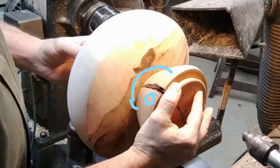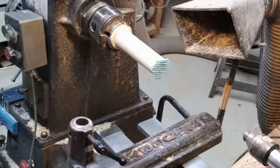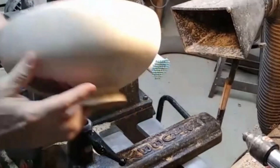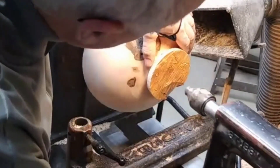However, in this case, because it's so thin, I'm going to go with a third choice, and that is this one here. This diameter roughly matches the ID of the entry hole, but it allows a little bit of movement. This surface is concave a little bit, so that it's dished out, if you will. And I hot glued a little piece of shelf liner on there. So that's going to press on the bottom of the wood. You can't get better than that. You're not stressing any of the thin walls of the piece.